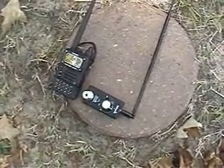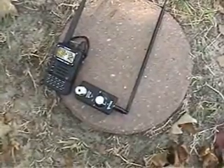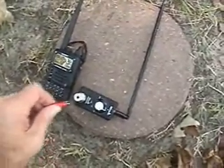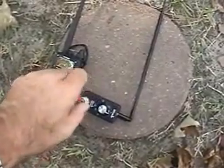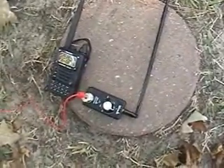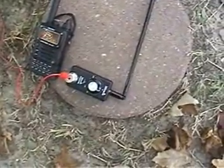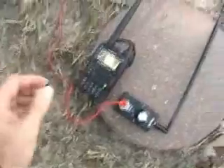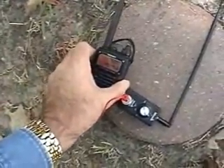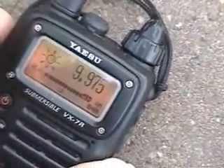All right, through the magic of video, we've gotten the Yaesu VX7 and the Miracle Whip here, sort of laying them on the ground — about the worst place you're ever going to want to get a receive signal, but we're going to do it this way anyway, make it difficult. What I'm going to do now is connect this alligator clip to the coupler antenna coupler of the Miracle Whip. We've tuned the coupler to about just under 10 megacycles, which is where we had our minimal signal coming in from the shortwave broadcaster. And as you see, we now have basically pegged the meter at 9.975 shortwave broadcaster, and the antenna is lying on the ground.